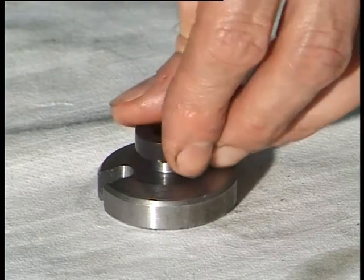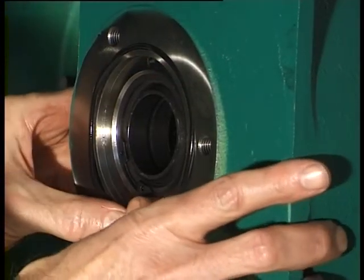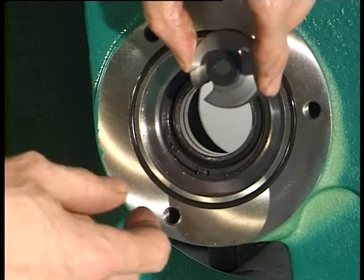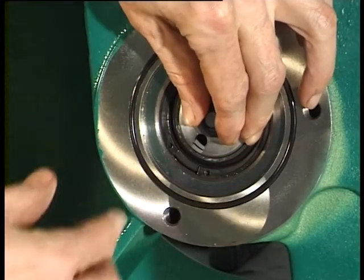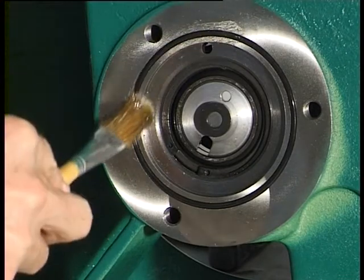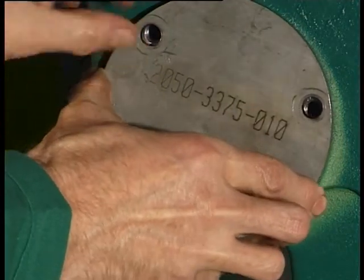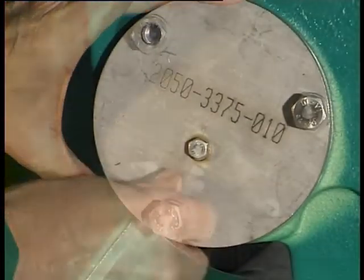Place the gasket on the shoulder of the bottom bearing pressure piece. Insert the gasket in the groove. Fit the bottom bearing pressure piece with fitted gasket in the pivoting bearing. The recess in the bottom bearing pressure piece must point to the bore. Grease the gasket as specified in the lubrication schedule. Mount the bearing cover, paying attention to correct positioning. The hex head screw is glued in with Loctite 275. Screw the three M10 20mm hex head screws with lock washers into the bearing cover.